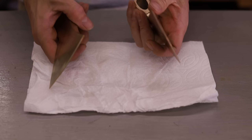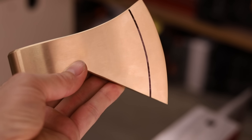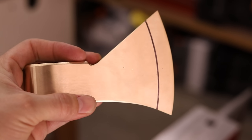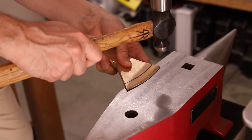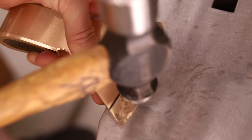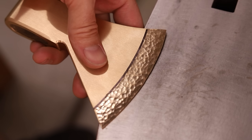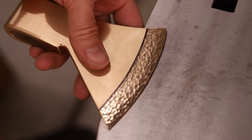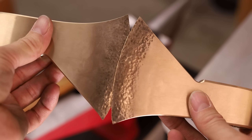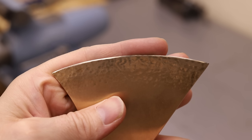They're starting to look really nice. Now I need to cold forge the edges to make them much stronger. I'm drawing lines to use as a guide to make sure that I don't go crazy with the hammer marks — I'm going to leave them on the hatchet because I think they're going to look really cool, so I want them to look uniform. When cold forging bronze, you can actually feel it starting to get harder and harder. The first hammer hits are really soft, but as you keep hitting the same spot repeatedly, it becomes a lot harder and the hammer starts to bounce off the metal. The edges still aren't sharp, so I just filed in a really broad edge to keep them as strong as possible. I believe this is what's referred to as an apple seed edge.